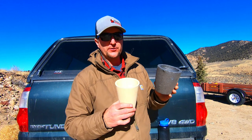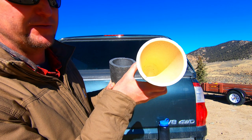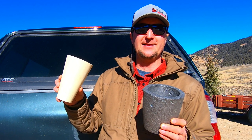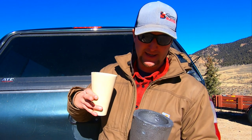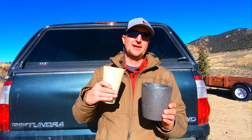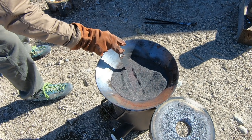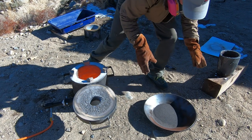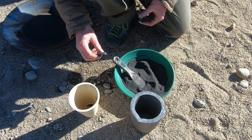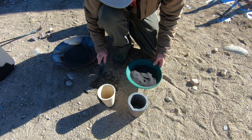For this smelt I'm using clean crucibles. The flat-bottom crucible versus the round-bottom — the round-bottom crucibles pour out much better and retain less slag and collector metal. We're going to use Chapman flux because it expands less than my other flux recipe; the less it expands, the smaller crucible I can use. Here are our magnetite cons with Chapman flux — this white stuff is flux thinner. We're doing two smelts at 45 grams of collector each, split up evenly.